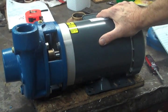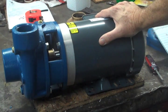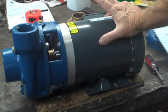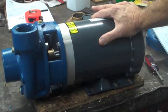Here we have a small Scott pump. This is a number 16 pump with a JM frame motor. The JM and JP frame motor uses what's called a cartridge seal. It is something you have to assemble yourself, but it's a little different than a regular seal kit in that you have to put the seal rotating head on the sleeve before you install it. I'm going to pull this one apart, and then I'm going to show you how to put that back together with the seal kit.